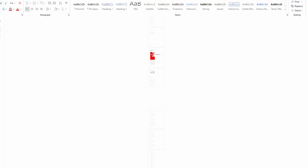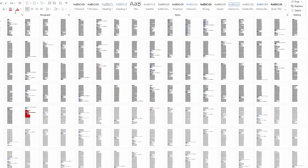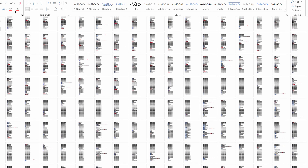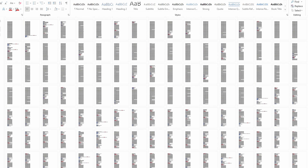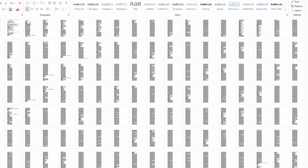We're on page 274, so we need to delete 273 pages worth of G-code. The way I like to do it is zoom out as much as possible — that's why I highlighted it in red — and then select all the way up to the top. Remember we still want to keep the first page because that sets up all our base information. We delete all those pages and now we're basically starting this whole print at the seven millimeter layer height.